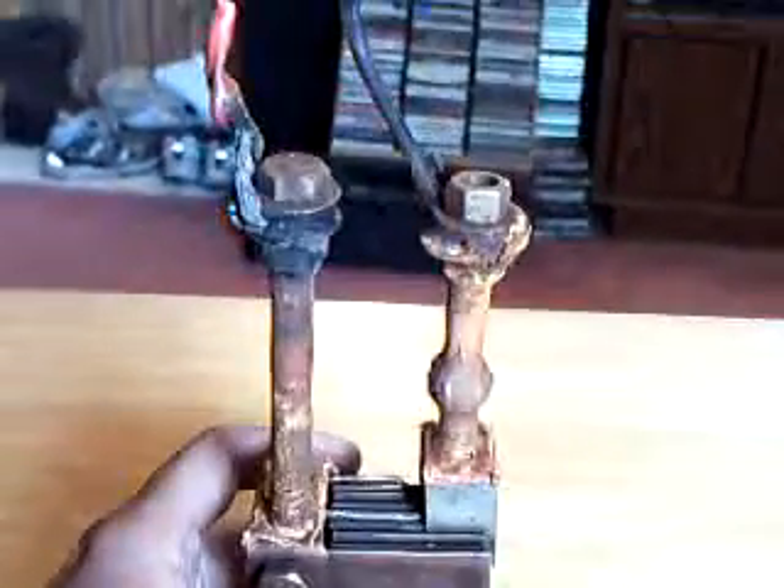I've seen it on YouTube before. Guys, do not do that. Do not put your terminal wires in the solution. Keep your terminals outside the vessel and then hook your wires outside on the nut terminals. I've seen Zero Fossil Fuels say it before and now I'm saying it — I got extremely lucky on this.